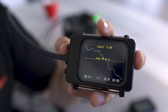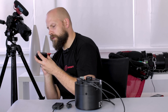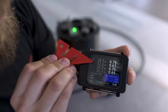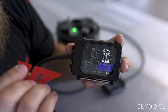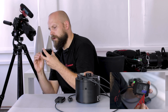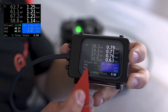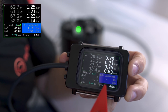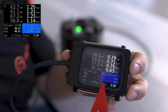The following screen is our graph of the dive we're performing. The next screen is our O2 sensor screen. Here you can see the pressure and voltage on our oxygen sensors. Over here you can see what our current diluent is and the partial pressure of the diluent at the current depth. In the bottom right corner you can see our stack time on our scrubber. Here we can see our helium content in the loop as detected by the individual helium sensors, and here we can see our indirectly measured PPO2 using the helium sensors.